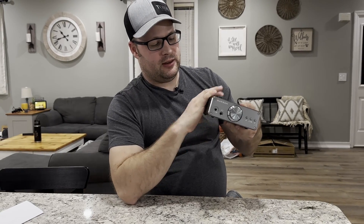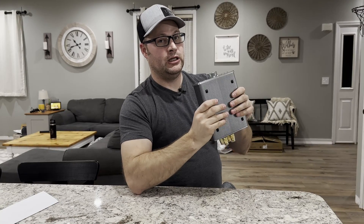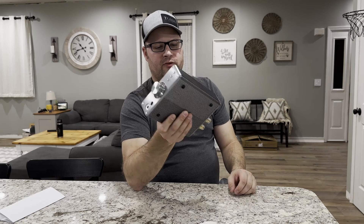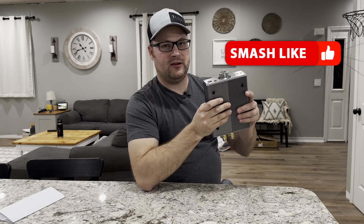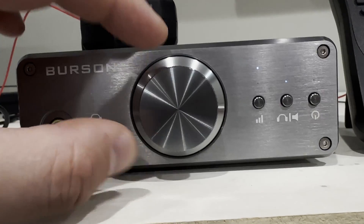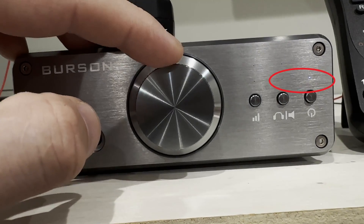Here's another issue I had. When I finished testing, this thing was hot — really, really warm to the touch. I wouldn't say I was going to burn myself, but it was warm enough that on a cold night I wouldn't mind having it under the covers. On top of that, at around three-quarters of the way through the test — using 4-ohm dummy loads and a 1kHz signal — the amplifier just shut off. Powered right off. That's something to keep in mind.